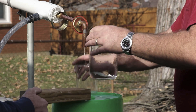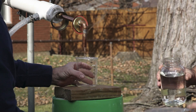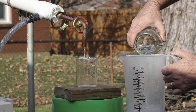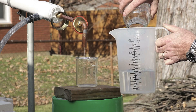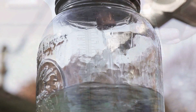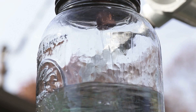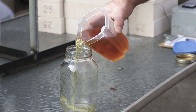I'm going to take that off and measure it. Got a graduated pitcher here — that's fraction number two, measured 800 milliliters. That's mainly 6 carbon molecules and lower. There were a total of five fractions, and the total volume was 3,100 milliliters.